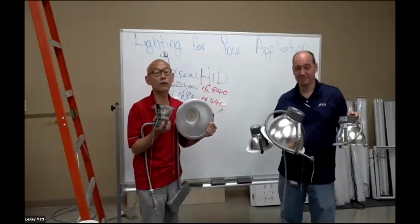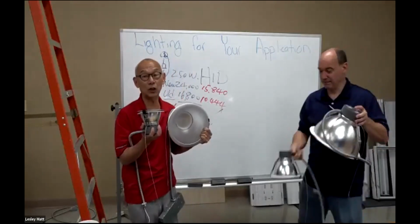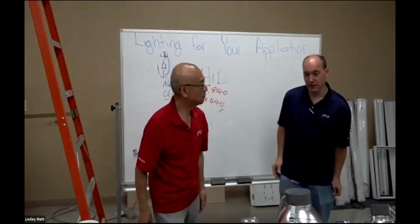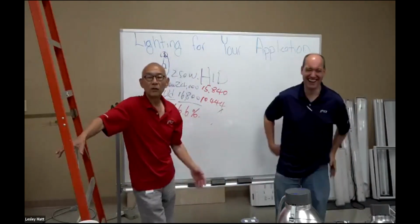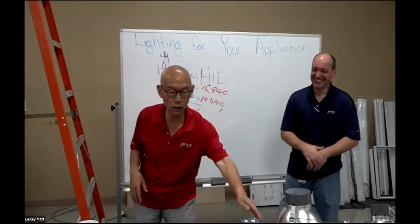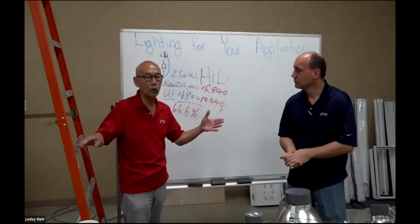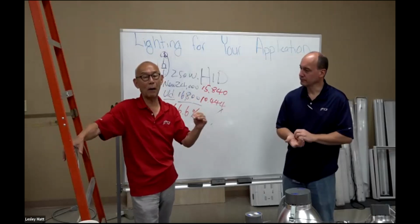And we have two different styles. One called standard. With standard, we have 3 wattages for each size, and for each wattage, each size, we have 5 different colors. Would you cycle the 5 different colors, Paul? So 5 different colors: 27, 30, 35, 40, and 50. The standard one uses an internal driver, called the integrated driver. We only go up to 30 watt, which is at the 10 inch or 12 inch. Those we believe are good up to 12, 15 feet.